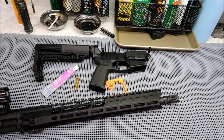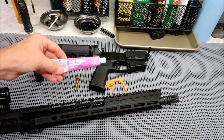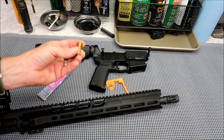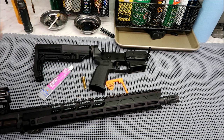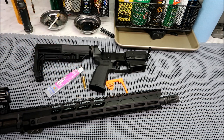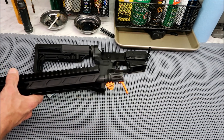He says, just keep going down the street here. Stop by the auto supply, get some valve grinding compound, and then go down a little further to the hardware store, get a brass screw. This one happens to be 5/16. Put that in your drill motor, put some grinding compound on the end of it, and put this thing in a vise and just go to town on it.